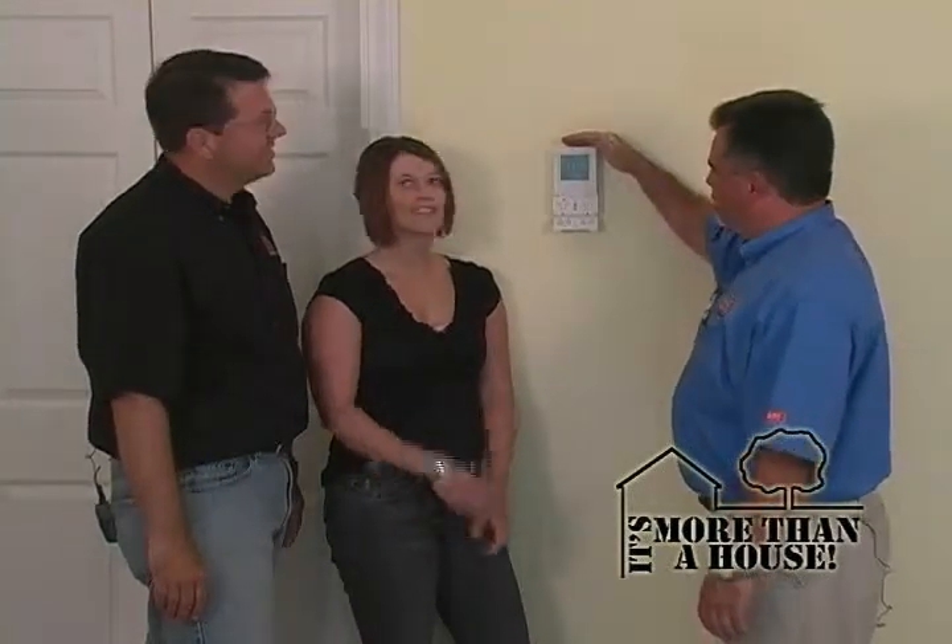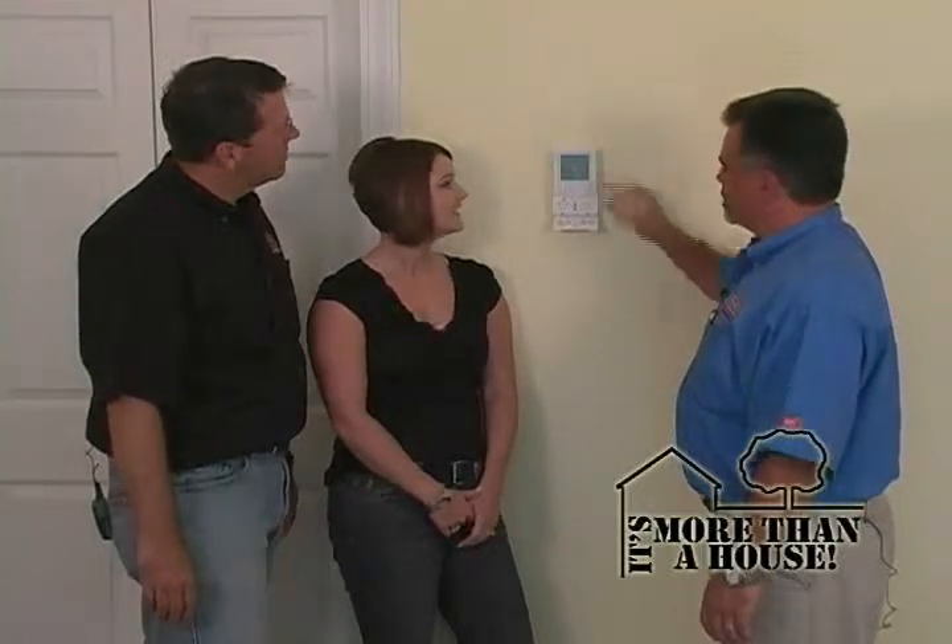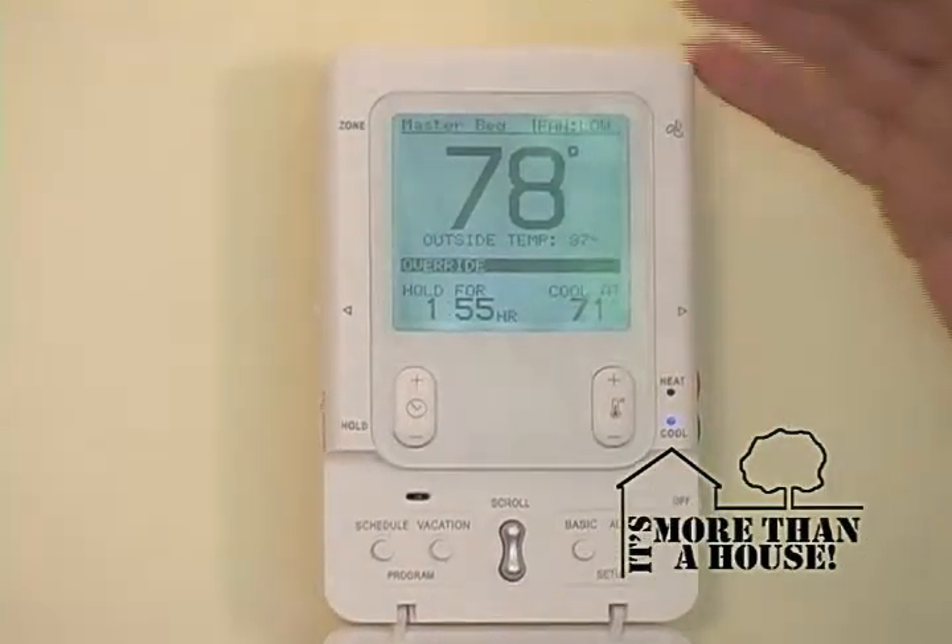Let's go upstairs and look at the master control unit — the user interface. We're in the master bedroom now — Command Central — and this is the user interface. It's a fancy word for the main thermostat. This is a Windows-based setup — it kind of looks like a PDA. This controller is constantly in communication not only with the furnace and the zoning controller, but also the outdoor condenser. It knows what temperature it is outside, what the humidity is inside, what zones are calling, and it determines a certain speed to run the outdoor unit or blower to achieve not only the best comfort, but to do it as efficiently as possible.